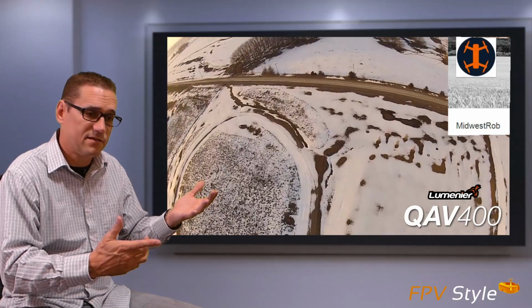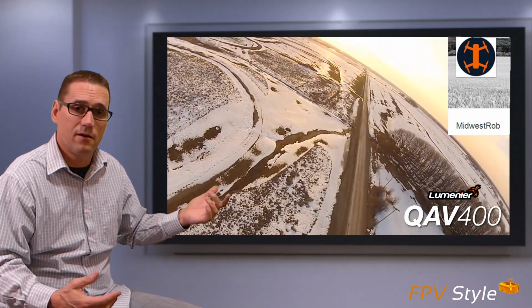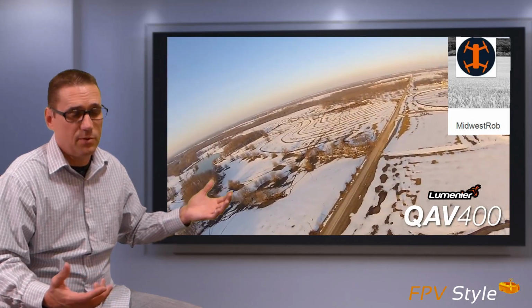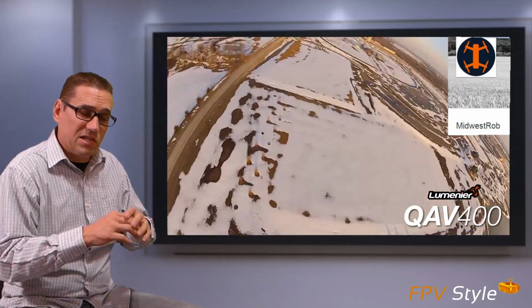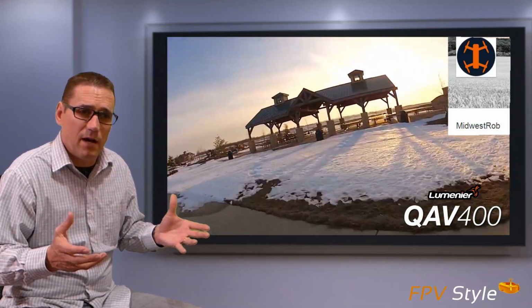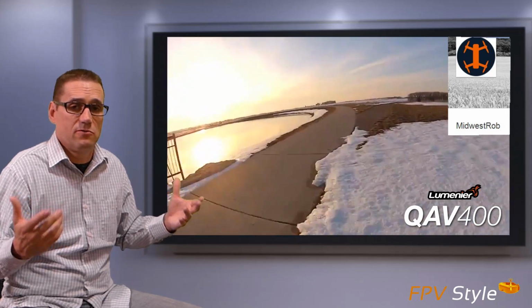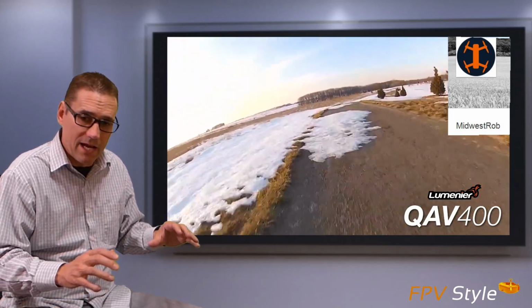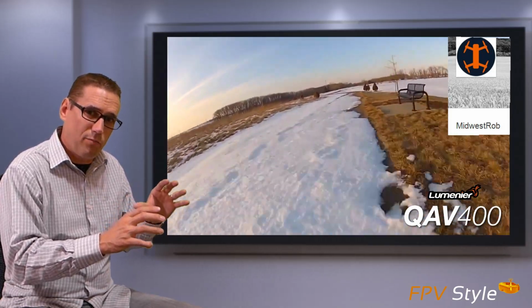We were averaging 8-minute flights on a 3,300 mAh pack with a 1,700 gram weight all up. That's pretty phenomenal. Nothing to complain about there. And like zero jello. When we edited our footage, I'm guessing probably 95 to 98% of our entire footage was usable because there's just no jello in any of it. It was fantastic. So anyway, that we believe is kind of the perfect combination, prop and motor.